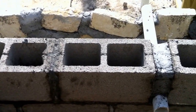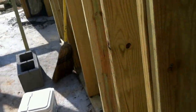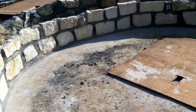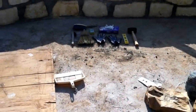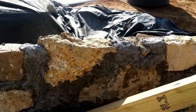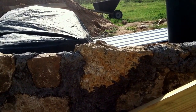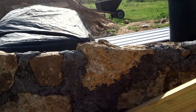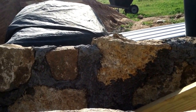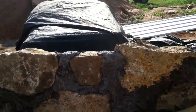If you're ever going to build a wall really fast, these cinder blocks are great — you can build up fast, it's even, and it's pretty easy. Then we did rocks all in here. This is all the stem wall. You've got to get the whole thing up at least 18 inches on the outside. On the inside, it's really up to you — whatever you want for aesthetic reasons. We did two layers here to put in the rocks and make it look decent.